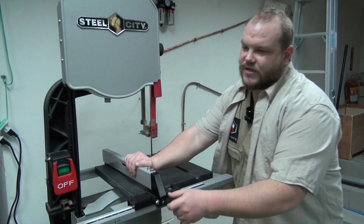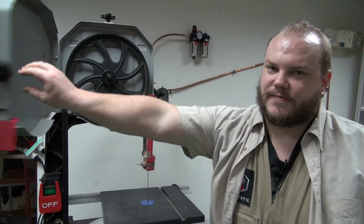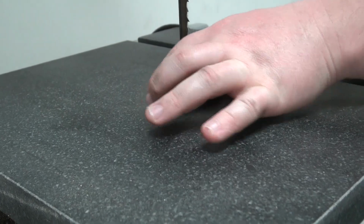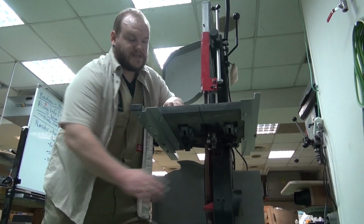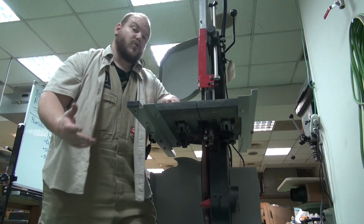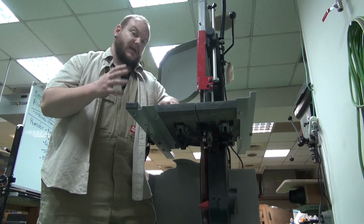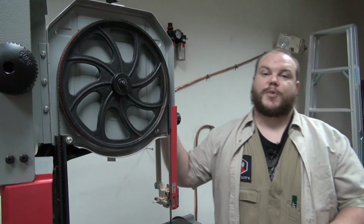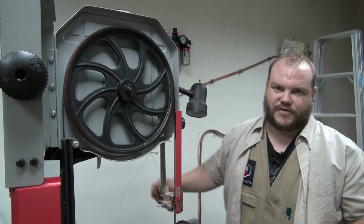Next, you want to take off the fence, pop up in your cabinets, and pop out the insert. Of course, normally there's a guard in here, but I've removed it because with it in place, you really can't see what's going on with the bearings from this angle. Now drop the blade tension off by loosening off the tensioning arm.